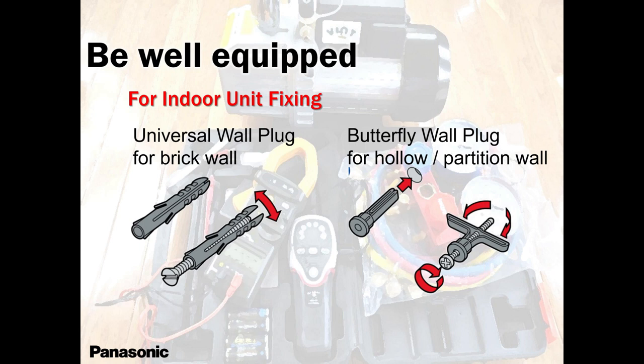You don't want that rattling, because when the inner unit is filled with refrigerant, when the unit is running and cooling and heating, you name it, it becomes heavy. Because when you're mounting it, it has no refrigerant. But once the refrigerant comes in, especially in cooling, liquid, it's really, really heavy.